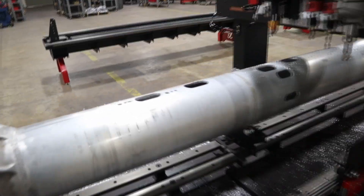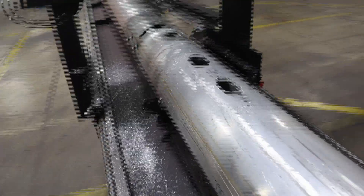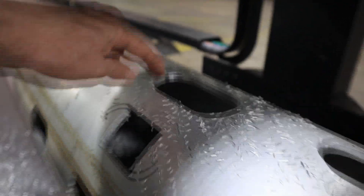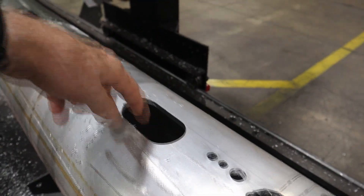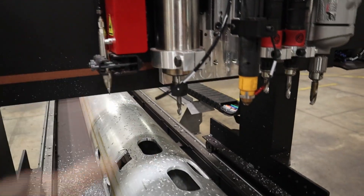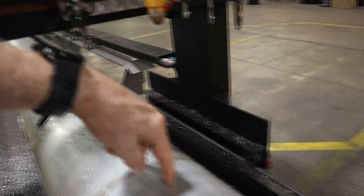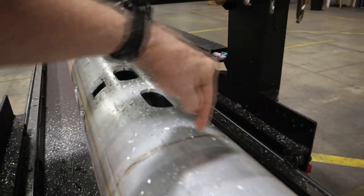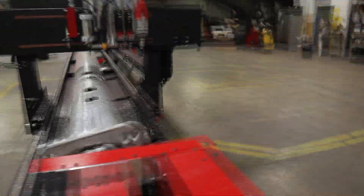You can see we've been drilling holes here. Let me walk to this side so you can see the finish we're getting — very pretty darn good. What we're doing for this flagpole customer is plasma cutting the hole and then coming back and multi-pass milling it with the spindle. The new software also allows us to plasma cut holes vertically, so there's no more normalization — you don't get that oval look. You can now get a clean round hole, or we can still cut it normalized if preferred.